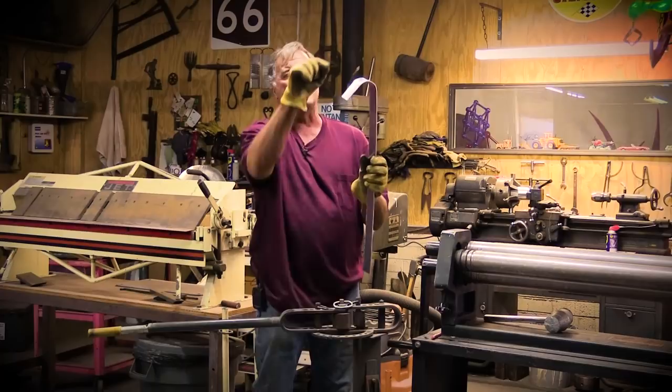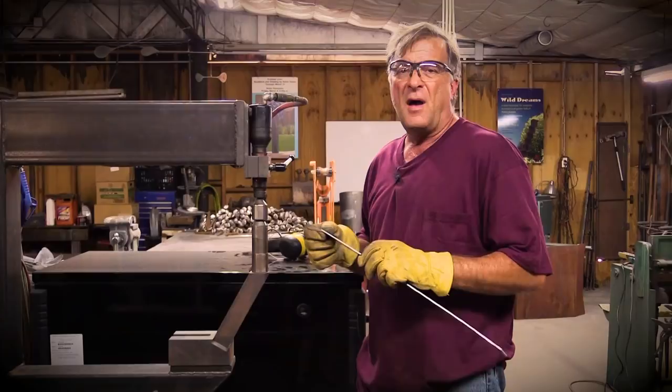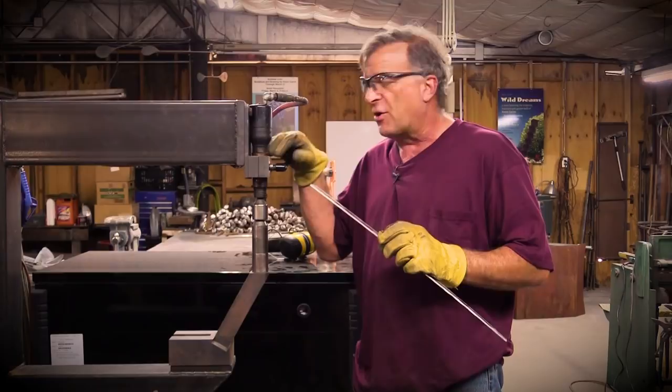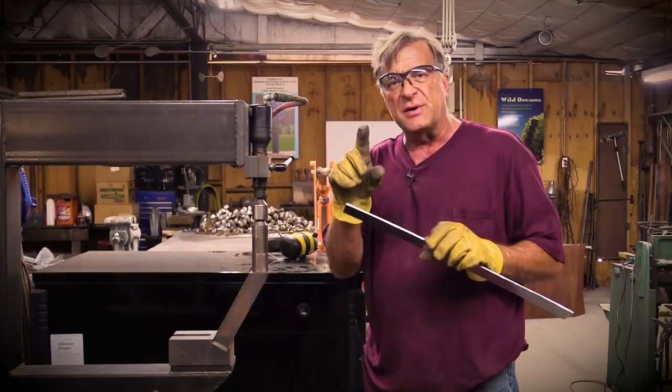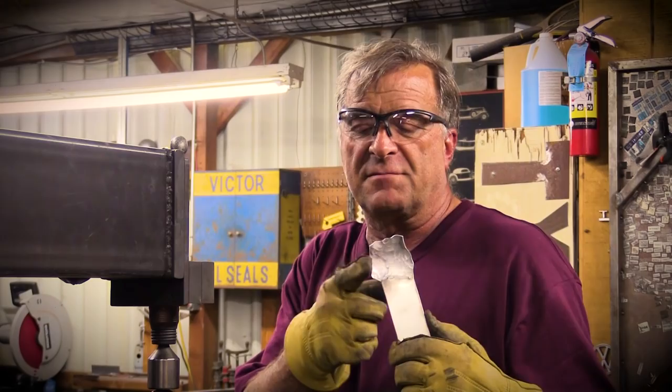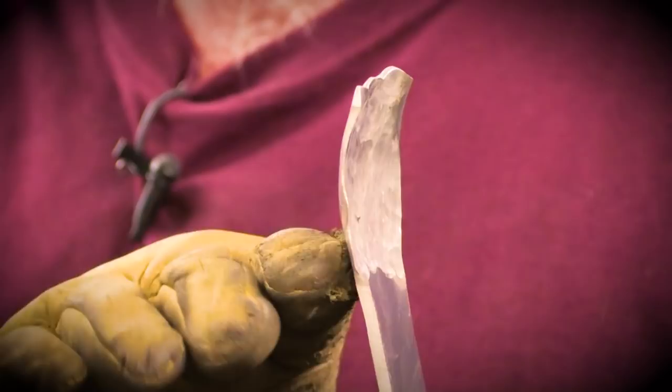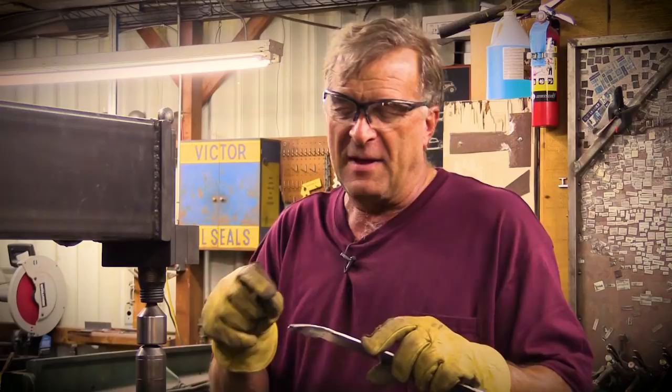And another little thing that can happen — let's say you're just trying to shape it a little. You want to put a little curve into that piece of aluminum. This is an eighth inch aluminum and my air shaper here. What I wanted to do was just hammer on this a little bit to show you a couple of things that could happen. It's going to get deformed, get all bent out of shape — not the way you want. It's also going to get thin. That's kind of what happens when you're not paying attention — you might have the music turned up too loud and you lose your shape, wind up with something you didn't intend. And you can see how thin it got right here on the edge, moving the metal off of the anvil. All of that hammering is also raising the temperature — it's getting hot. You beat on it, it gets hot. The hotter you get it, the more brittle it can become. Not only is it thin, but now it's brittle and it can break.